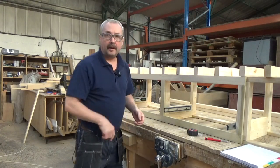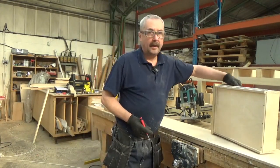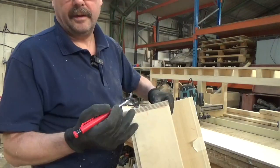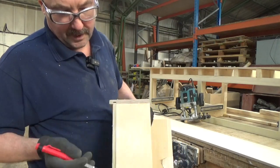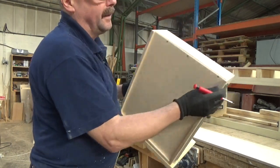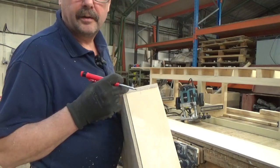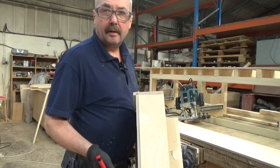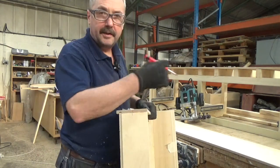So, we've got some board ripped there — two strips ripped. We're reproducing what we've done with these other boxes: two sides, routing that 9mm slot out, 10mm up from the front edge, and a 9mm panel inside. This is 12mm — 12.5mm frame, 9mm bottom. Strong as an ox. These are 280 deep.